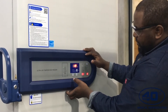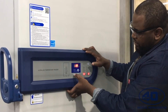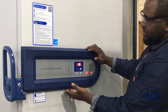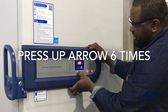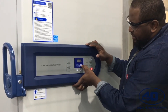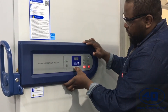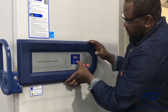There's a controller with three keys: a set key, an up arrow key, and a down arrow key. The passcode for the controller is the number 6. Use the up arrow key to change the value to 6, then press and hold the set key for five seconds until the lock light goes off.